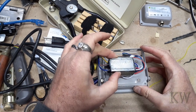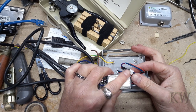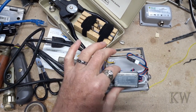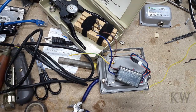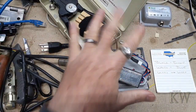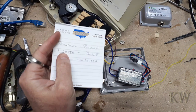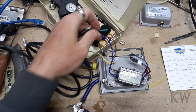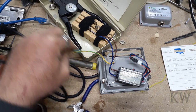So you can see how this works — it's got the little LED driver. It's got like a little plug, but it looks like all the pins are just stuck in and shrink-taped. It's a way to save some money. We've got the driver and the ground wire, which we'll re-ground. If you ever want to know how these go together — anything from China always says blue, brown, yellow-green — basically: black to brown, white to blue, green to green. So you take the American plug: black to brown, white to blue, green to green.